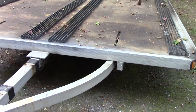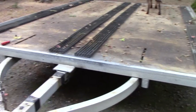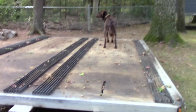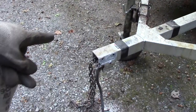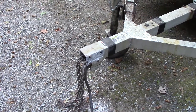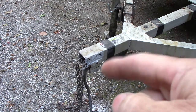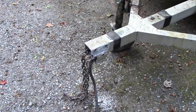I'm going about this all wrong. This trailer here - I think I'm going to name this video 'aluminum trailers, our potential death trap.' I was working on this last week. A friend of mine, Tom, says the aluminum starts to look like Alka-Seltzer, and boy was he right. When you put steel on aluminum it just wreaks havoc over time, corrodes.